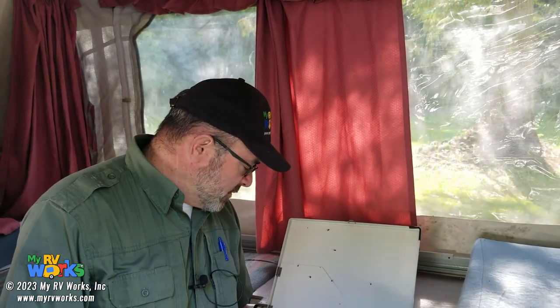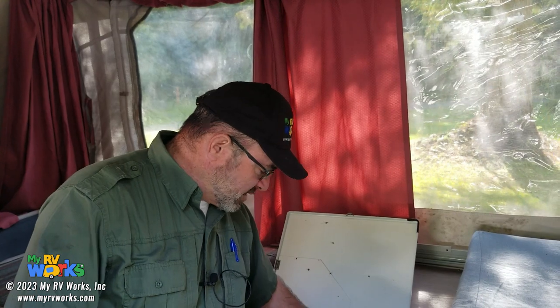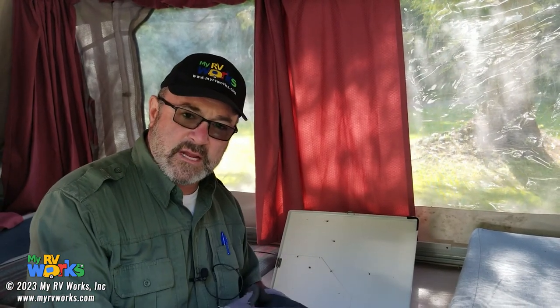Okay, so what I'm going to do is get my wrench, backup wrench, take this off, put a fitting in there, connect a manometer to it, and we'll check our pressure. All right, let's get doing that now. Okay, so I've gone and gotten my manometer and all my tools, and we're going to be doing it here.